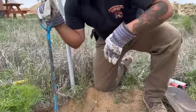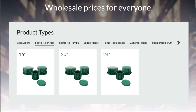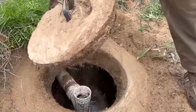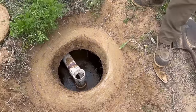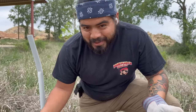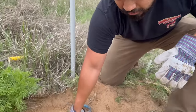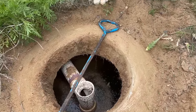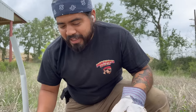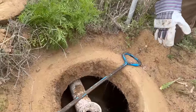We've got our septic tank lid exposed right here. This is a 20-inch lid. They offer 16, 20, and 24-inch riser sets. What you want to do is once you find the lid, pop it open. There's our inlet right there. Get a tape measure and measure across. If you have a square or rectangular lid, measure across the longest part. They have a chart on WholesaleSepticSupply that can refer you to which size you need based on the length across the lid.